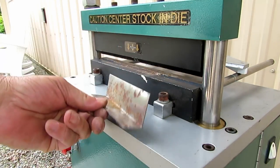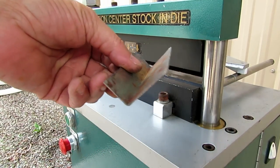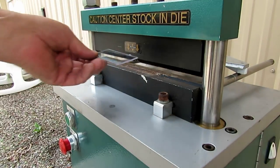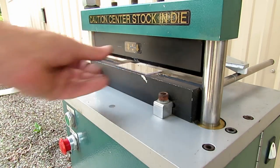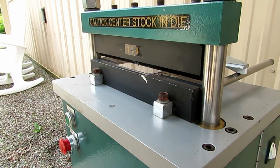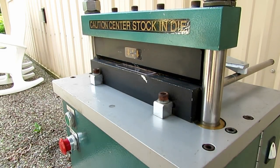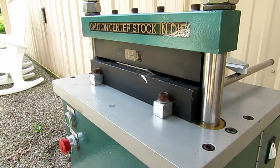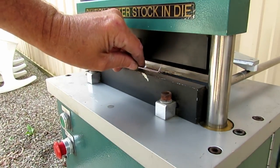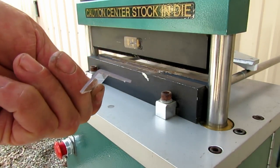There we have it — a piece of 18 gauge bent. I also use it for bending up a lot of plastic safety covers. It does a good job on polycarbonate, though you do have to overbend a little bit.